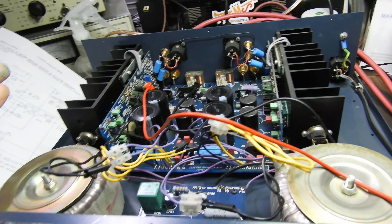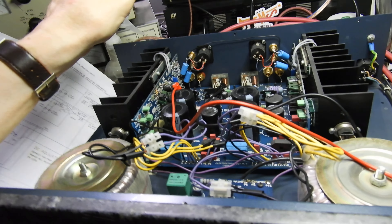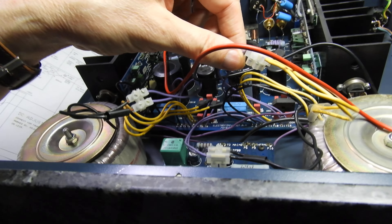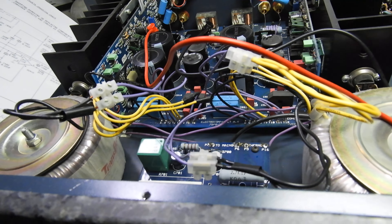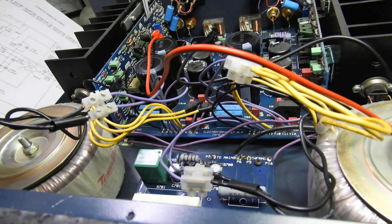So what have we got here? It's very similar to a standard one. It has different connectors and I think bigger transformers, but as you can see it has been worked on. These terminal blocks suggest that somebody was measuring current as they fired it up and did not restore it back to normal.